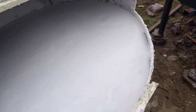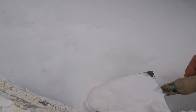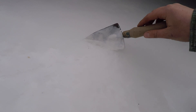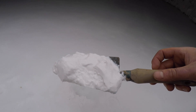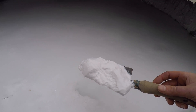This is going to sit here now for probably around about six months, and then it's going to be used for lime plaster. Let me get a little shovel and show you the stuff. See that — it's going to compact and become solid, almost like a thick cream cheese consistency. It won't fall apart like that — it's very wet at the moment. But that's the stuff. We mix that with sand at different ratios depending on what we're doing — we'll go through that when we come to use it.